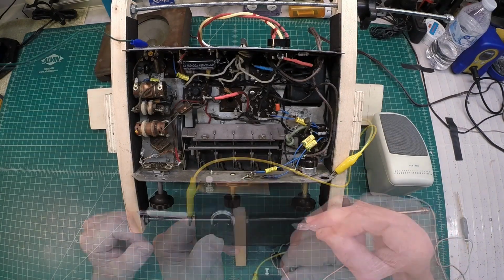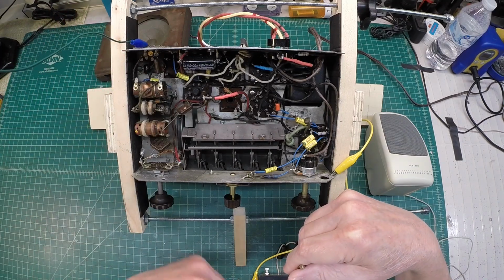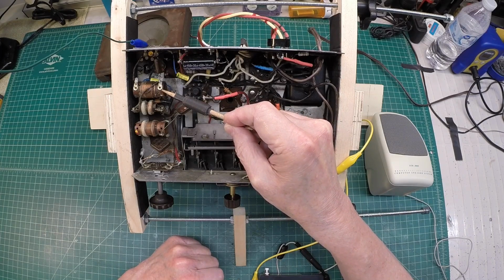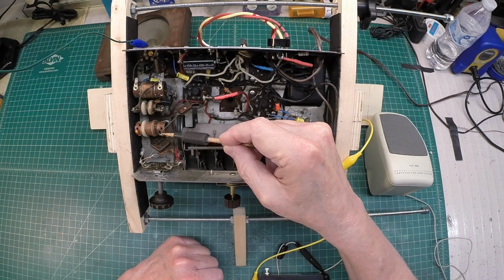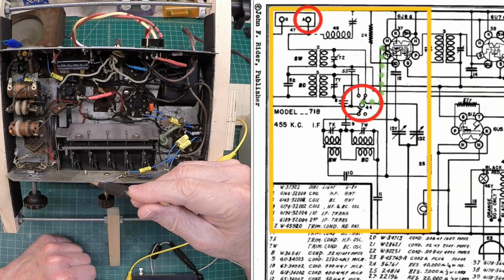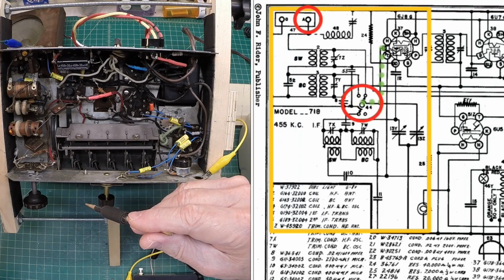Let's get started. Since this radio is operating, I'm going to just leverage the outside signals I'm able to receive here. For this particular radio, you can see this is the shortwave coil, the broadcast coil, and this is the combined oscillator coil in this example for the shortwave bands that this radio receives, as well as the broadcast band. If you look at the schematic that I'm sharing, you'll see the tank circuit where the signal comes in here off of the antenna itself.